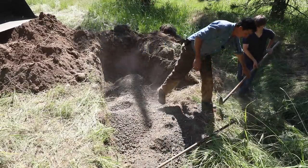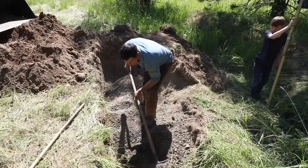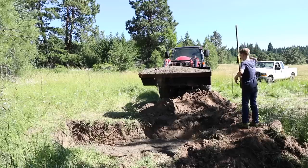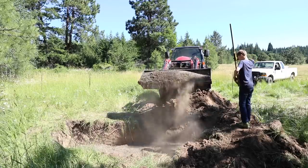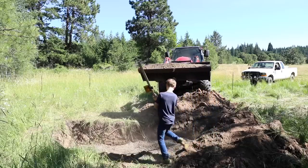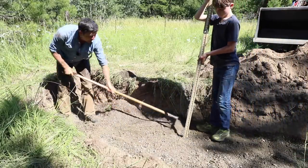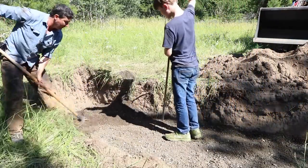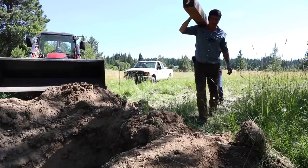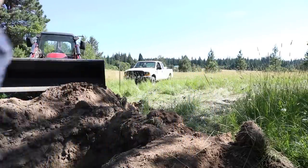I'll rake if you want to grab the grade rod, and we'll rake it right straight to grade, starting on this end right here. Give me a check right there. Watch your footing here. Are we using both logs? Nope, just one per side. Let's place it right in the middle.